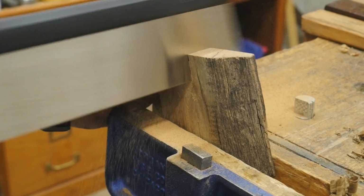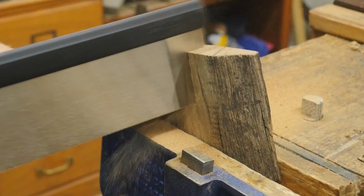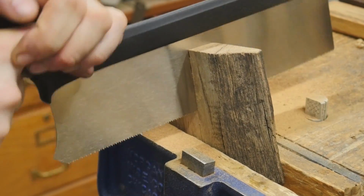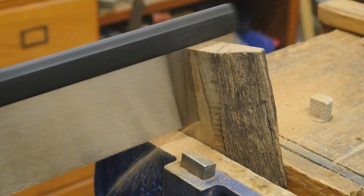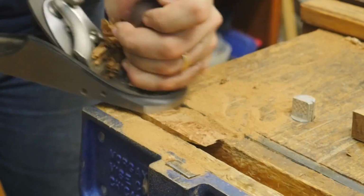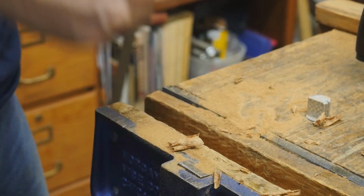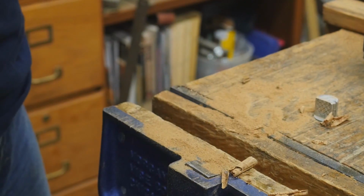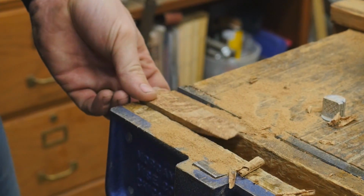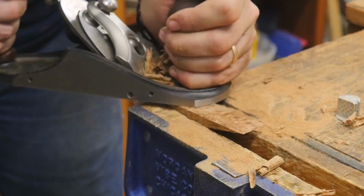After drawing them out, I can put them in the vise and cut down all of the faces of the triangles, and then I can put all of those individual pieces into the vise and smooth them out with a plane to give them a nice clean surface ready for glue and finish. Just make sure that all of the flat surfaces are smooth. And with the geometric shape, that's actually pretty easy and a simple step to do.